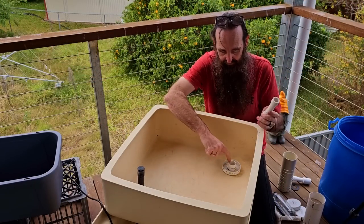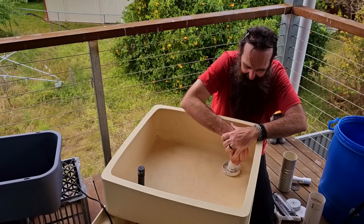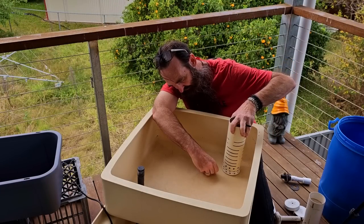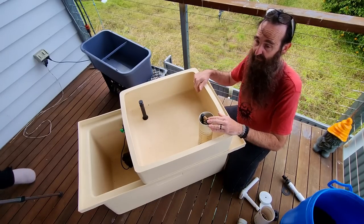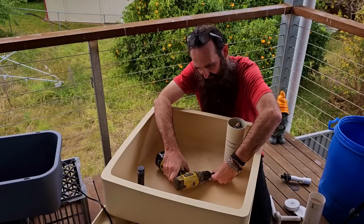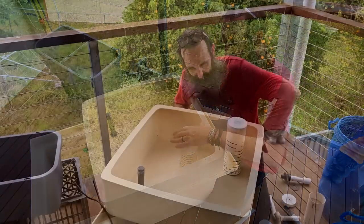For the stand pipe, because this is a one inch fitting, what I'll be doing is putting a little one inch to three quarter inch reducer — so 25 mil to 20 reducer — on the end of a pipe, and then that goes in there like that and it'll siphon over the top, and then we can put our shroud in. I've got three marks there on the pipe that I can just match up nicely. I do have three holes here for screws but I'm not going to worry about all three — this is basically just to stop people from pulling out the shroud. That'll hold it firmly in place, and then we put our end cap on top and we're pretty much all finished there.